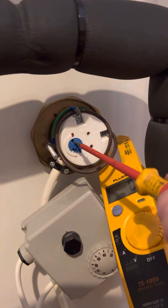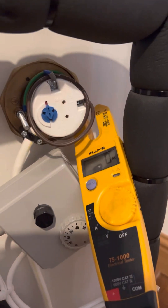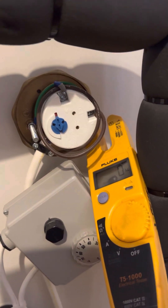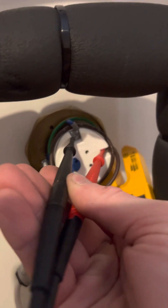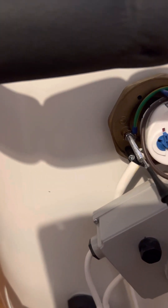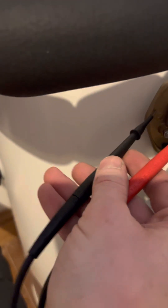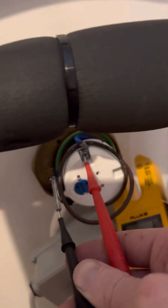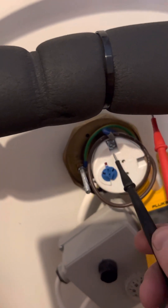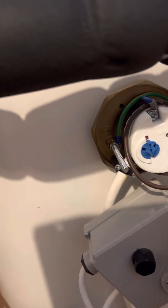First check: I'm going to set the immersion to max, ensuring the cylinder is below demand — i.e. cooler than what I'm calling for — and do a voltage and polarity check. From neutral to line I've got 230 volts. From earth to line I've got 230 volts. From earth to neutral I should have zero volts, so I know polarity is correct. If I've got 230 volts between earth and neutral, it's crossed and I need to do something. Voltage is on and it's operating.